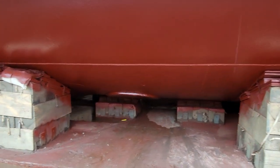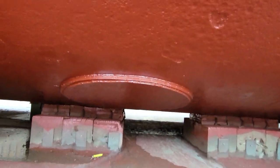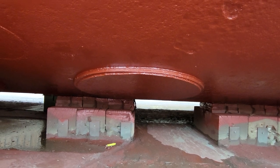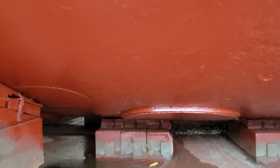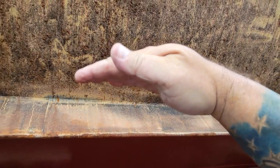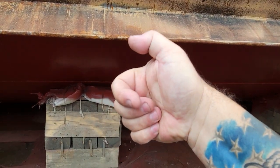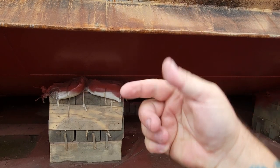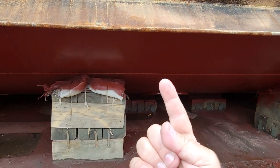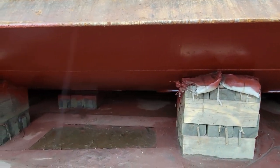Just a little bit farther down, you can see some of the larger blanking plates. That's going to be your standard ballast vent in the bottom, and there's another one back behind there. Those ballast vents are just open to the sea. Way up above in the superstructure, you have a vent cap that seals off this whole tank — kind of like putting your thumb on top of a straw and dropping it into water. You'd still maintain air inside that straw, but as soon as you pop that vent, the water will rush in through the bottom and fill it up. That's what happens with these tanks, and that's what makes the submarine heavier and less buoyant so she will submerge.